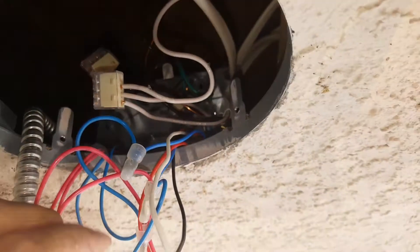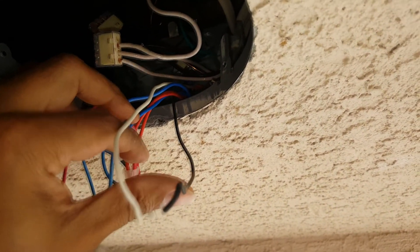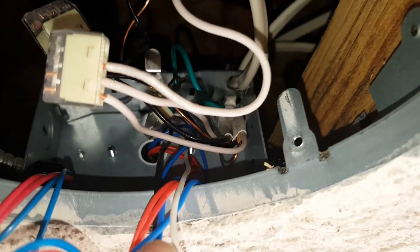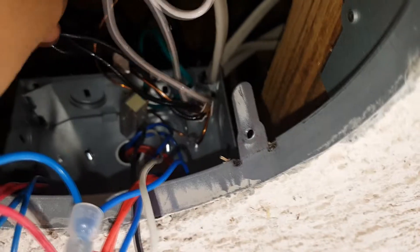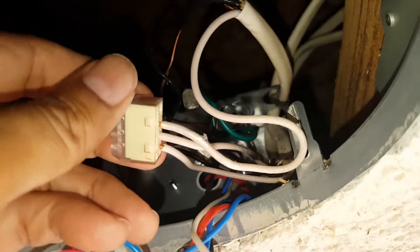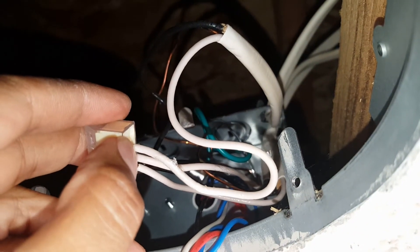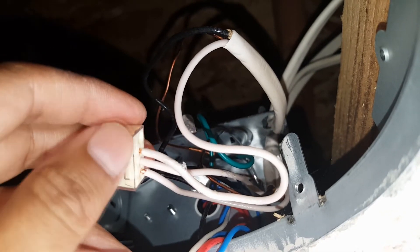What I've been able to manage so far: there is a black wire and a white wire that are powering the ballast behind this box. The black wire is where the power is and the white one is the neutral. I've been able to disconnect them — basically you grab on the wire and while twisting and pulling, the wire will come out.